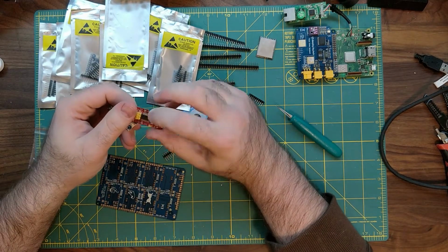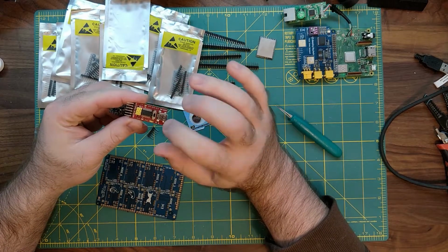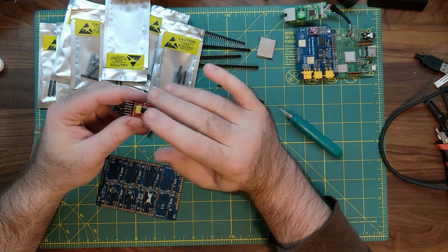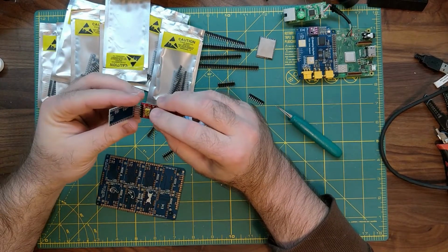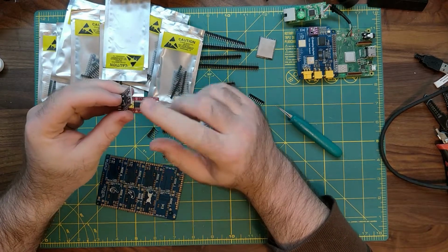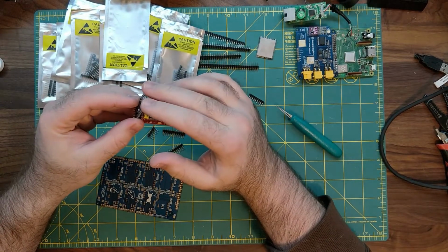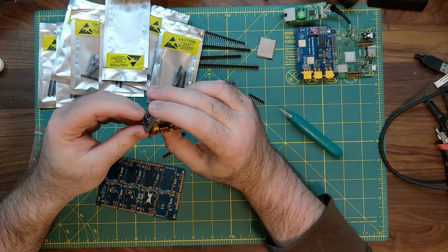There are actually two LEDs on either side, and that's showing you the RX and the TX line connections. The ones and the zeros going back and forward, zero obviously being off, one being flashing. So this will flash back and forward all the time. If you don't have a good connection, this won't flash. The only reason why it flashes is it's transmitting to something and receiving information from something. So it sends a lot of information to the board, and then it'll receive a lot of information verifying that it's actually flashed correctly.